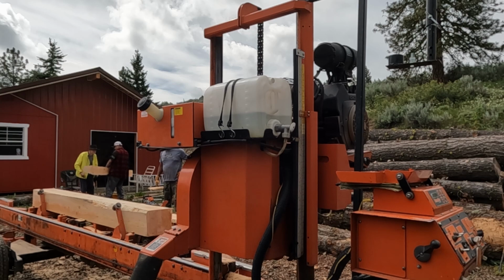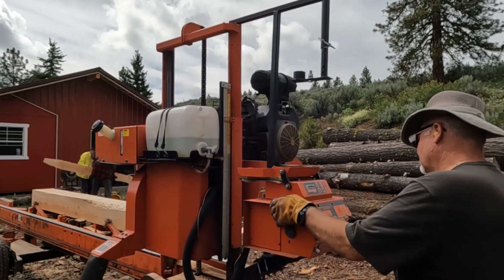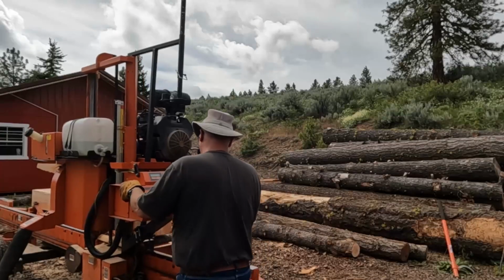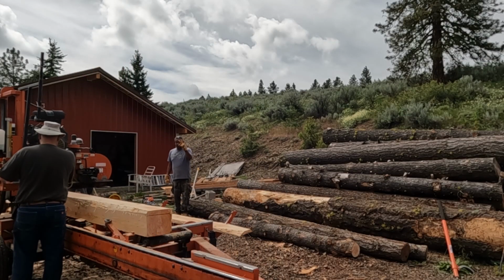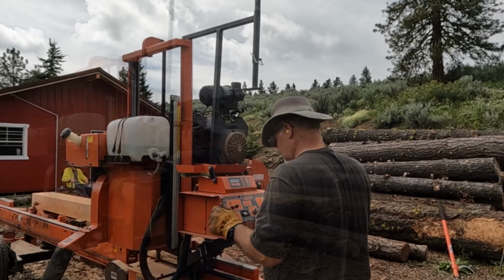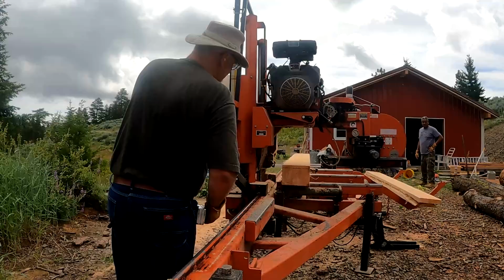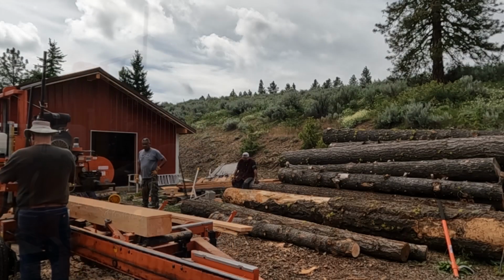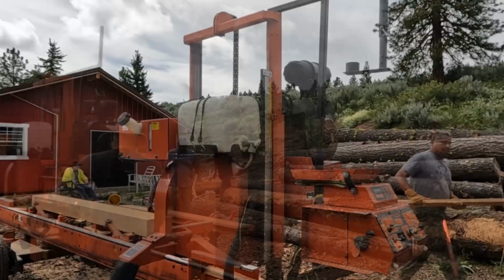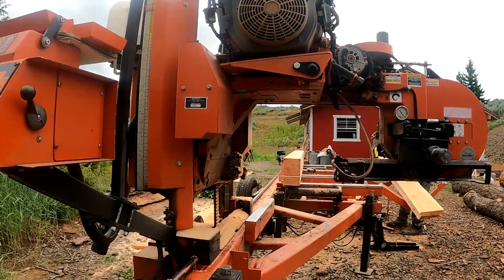Was I looking for 11 3/8, or was it 11 5/8, right? So especially when you're milling a lot like this, and you know you're going to be doing a whole bunch of 1 5/8 by 5 5/8, 2x6s, that way they're going to shrink a little bit, get close to dimensional. You can just write those numbers right on the cover for the simple set. Makes it really easy. And here's a case right here where I'm just taking a little thin cutout. That's because I'm that close to the cant. I can take a 1-inch board out, knock it off the side to my cant size, and then I can roll it up and start knocking 2x6s off of it. All right, we're going to knock this one down, and I'll let it run a bit here.